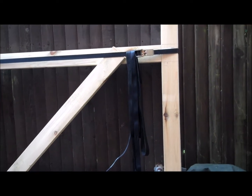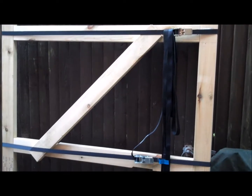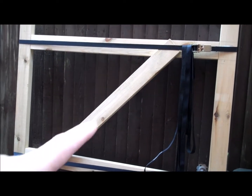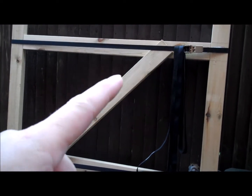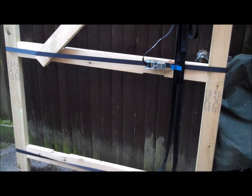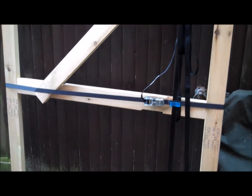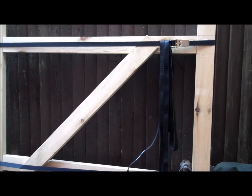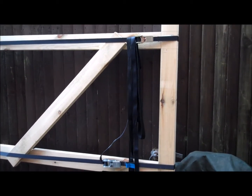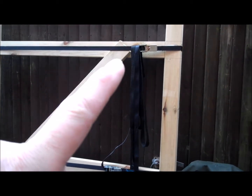So in this video I'm aiming, if I can get it all in, to finish off the braces. So the brace is in place, I've measured and marked it, so I shall undo it, cut all the joints onto that, fit that, do the one down there, and then we'll fit it in position and put the cladding on it. So yeah, I'll crack on and I'll show you the tenon joint on the braces.